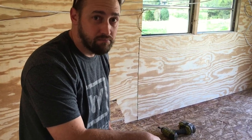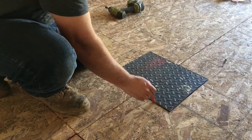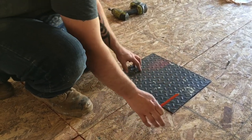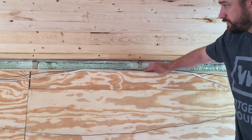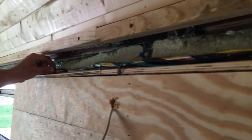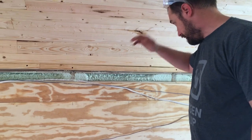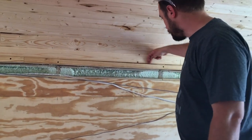So what are you trying to do? I'm making a square hole the same size as this plate, and then I'm going to make a piece of wood with insulation underneath it and a hinge — like a piano hinge — so that it will open up. And then this little strip: all the wiring will go in this strip, just like behind you. See how I've secured it with these little holders right here? The wiring goes down through the bottom and out the walls wherever it needs to go. Then there'll be a piece of finished plywood that'll go over this and hang over this lip maybe an inch or so.